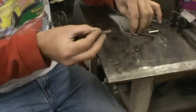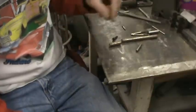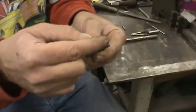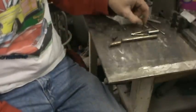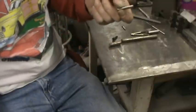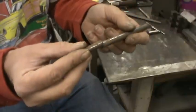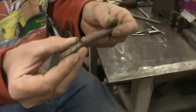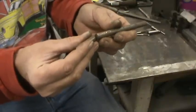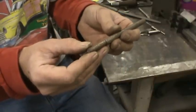The third option — and I don't have one here — is a roll pin or spring pin, which is a hollow pin with a slot down it. A roll pin is not a very precise way of locating a part, but for what Greg was doing it would be perfect and probably the fastest and easiest way to do it. A roll pin or spring pin presses in — you want them to have a slight press — and the slit in it is very forgiving if you don't have the tools to machine the exact diameter that you need.